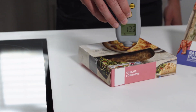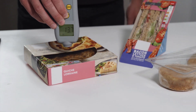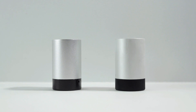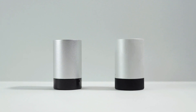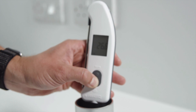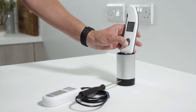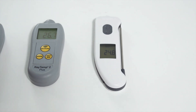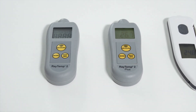With infrared thermometers, calibration tests need to be carried out very carefully to get an accurate reading. There are two options for your infrared device: a comparator cup or black body calibrator. The ETI comparator cup is a budget option, ideal for calibrating smaller numbers of infrared devices on a less frequent basis. To use, insert a high accuracy probe into the base of the cup as your reference point, then take the reading inside the cup using your infrared device and compare the two readings. The limitation is that it's difficult to use the cup to calibrate your IR thermometer at different temperatures, particularly high and low ones.